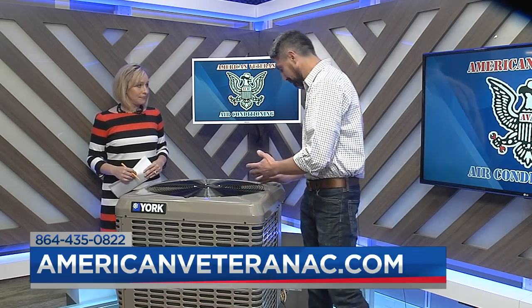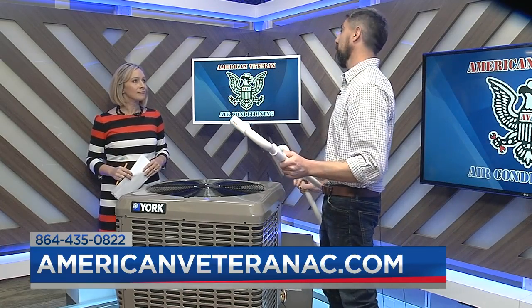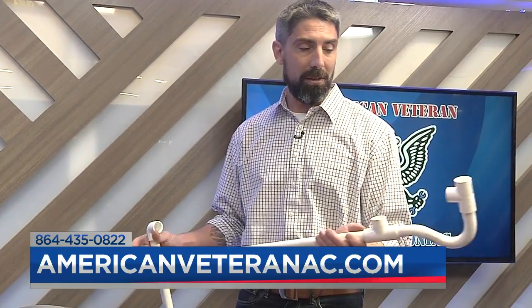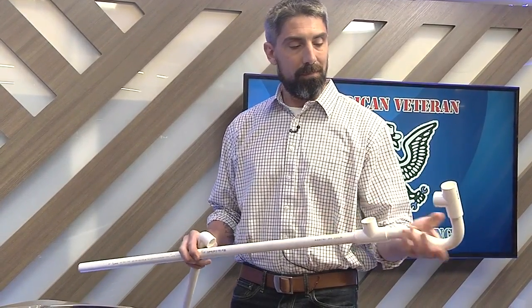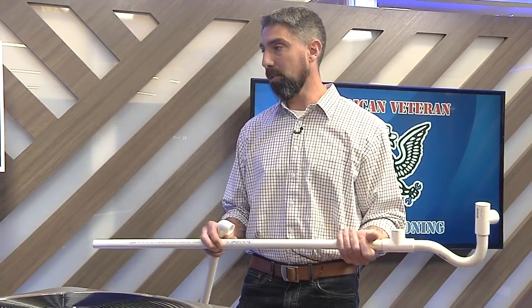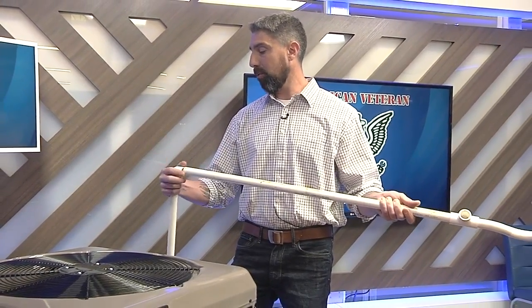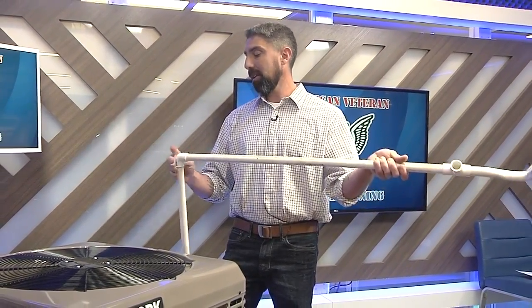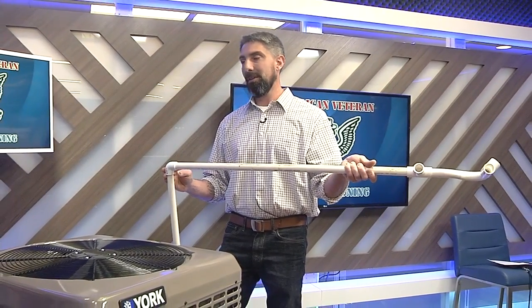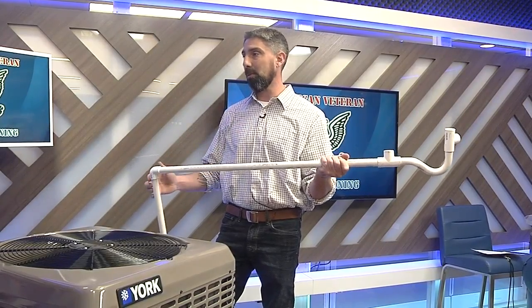We talked about keeping that drain hole clean. There's another piece of equipment in your attic — the air handler. We clean out the entire drain line on a maintenance or tune-up visit because it gets a lot of calcium buildup inside. Right where that hard 90-degree bend is, it plugs up. A simple cleaning — even as simple as pouring some bleach in there and allowing it to flow through — keeps that clear and solves a lot of problems and headaches in the future.